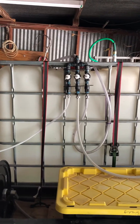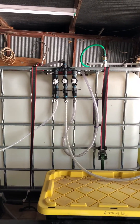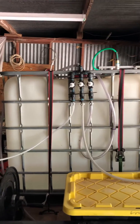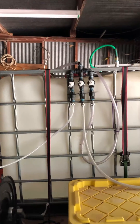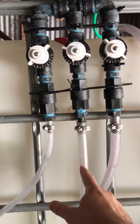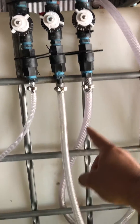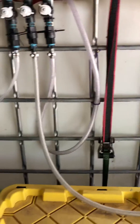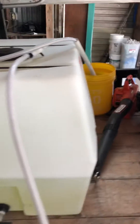What's going on everyone, Blake here from Efficient Washing Solutions LLC. I just wanted to provide a short video on how I plumbed my metering valve setup. Over here you have your soap line, bleach line, water line — the water line follows this short little curve and goes straight into this bulkhead up here. My soap line and bleach line are both drop sticks, so you have your soap line right here and all the way over here you have your bleach line.